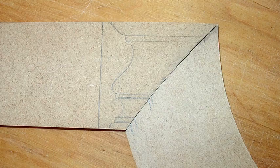So not only does Jasper have it drawn correctly, he now has a template that he can cut his curve with. Oh, so you use these pieces as your template. Yes. These are both templates. And now the next step is I'm just tracing a line across here so these templates match up exactly. And this is actually following the radius piece exactly, the same width and everything. So now the two templates match exactly, and they're ready to be attached to the molding. All right.